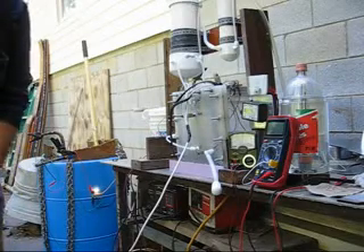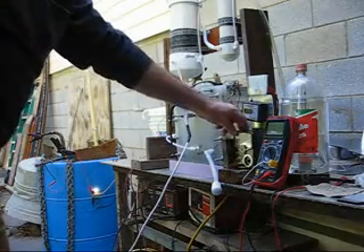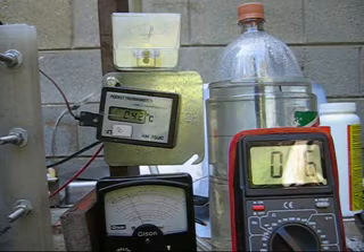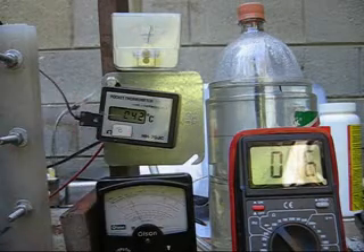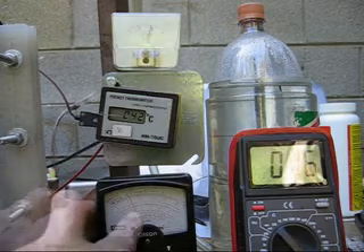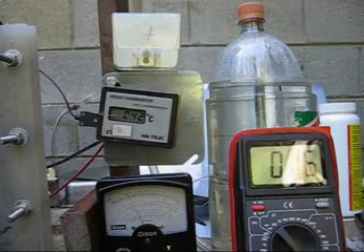So it's only 36°C. Anyway, now it's drawn up to 42°C after adding the hot electrolyte. My camera card ran out of room and I had to go empty it. I dumped hot electrolyte into this thing — it was 71°C, or 160°F — and it brought the temperature up to 42°C. It seems to have leveled off there. It's drawing 9.5 amps, pulling close to 13 volts, at 42°C.